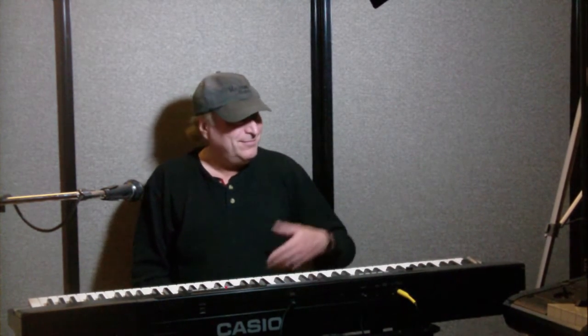Try it out at very low volume on your keyboard and slowly raise the volume. If it starts distorting, that's not one of the pedals that can handle the higher voltage of a keyboard. There is a way around that. As I mentioned, keyboards put out a voltage called line out and guitars put out a voltage called high Z out.